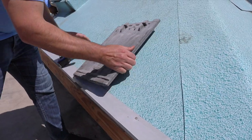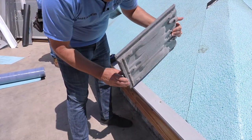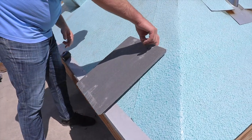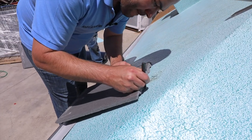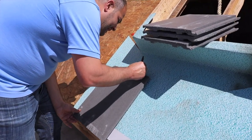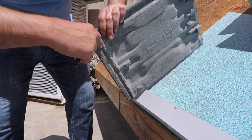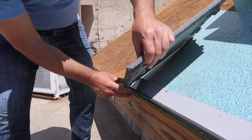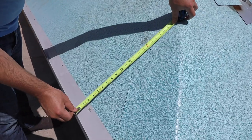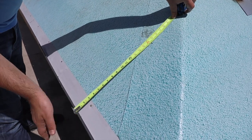The other way of doing it is you can align the tile — you can see that this groove is built for the tile eave riser. We can just make a mark right here, then come over and make another mark, and we need to snap a line between these two. This groove in the tile aligns with the eave riser so it sits nice and snug and locks into place. This measures 16 inches from the back of the eave riser, 16 and a quarter from the front of it.